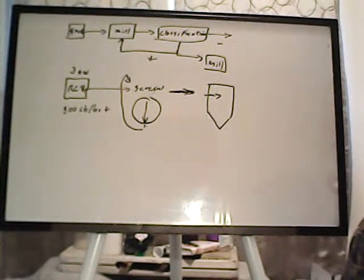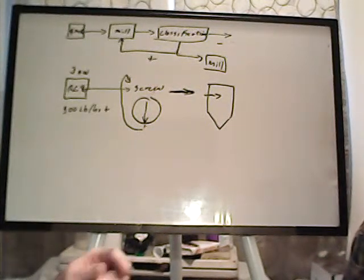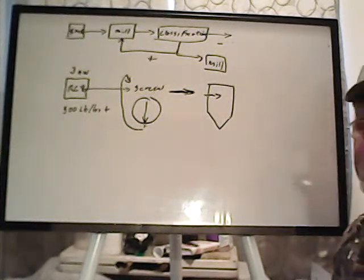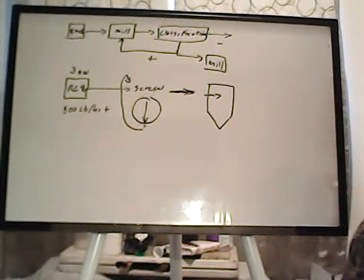The plan at the moment is to replace the heating element with a similar heating element that we make ourselves. The manufacturer charges $75 for one of those heating elements, which is a lot more than it costs to make. And by using the right size dowel, we should be able to just spin up our own. Coil it up. And so that's our evil plan.